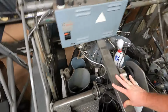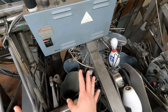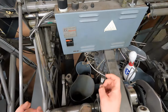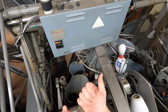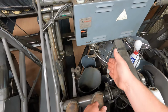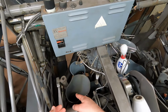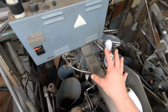Okay, the machine, obviously, you keep the machine on, but to tell you guys what's happening, in order to do a respot, you need to get the machine to 180. The only way you can get it to 180 is to force the machine to wait for pins. So when you did that first ball cycle, that set the rack that was in the deck assembly already. Okay, well, that's good and well. But we don't need those 10 pins on the deck. So we need to do second ball cycle again to get it to this point, 180.